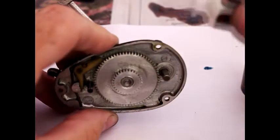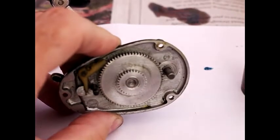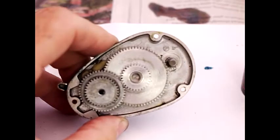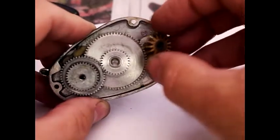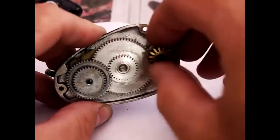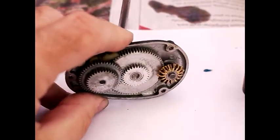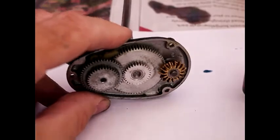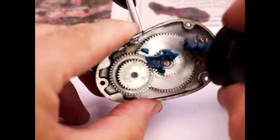In actual fact this is the plate that is used to wind the cam. The larger one goes into this, like here. There's a brass cog here — the brass cogs take the weight of the fish, and brass is obviously stronger than the zinc metal which is what the rest of it is made of. So the brass cog is essentially your power cog. I'm going to grease the cogs so they're all working properly — you don't really want to overdo this, just enough.